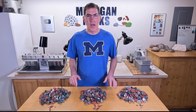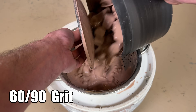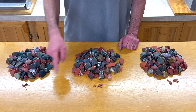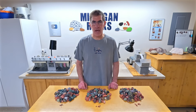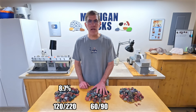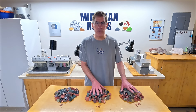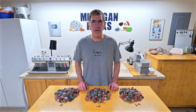I'm going to mix all these up again, weigh them all, make sure all the batches are as close as possible, and start them again. The second week's done, and we've still got some little chips coming off — not quite as many as last time, but still a significant amount. I'm weighing all the rocks dry before and after. This week the 120-220 batch lost 8.7%, the 60-90 lost 9.1%, and the 35-70 lost 9%. I'm surprised both times the 60-90s came out ahead — I thought maybe last week was a fluke. I'm also surprised how close the 60-90 and 35-70 are; it really doesn't seem to make a whole lot of difference. The 120-220 is definitely different, but those two are really close.